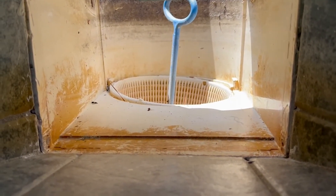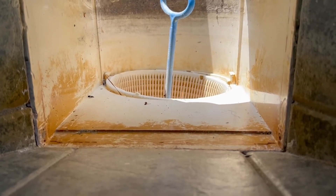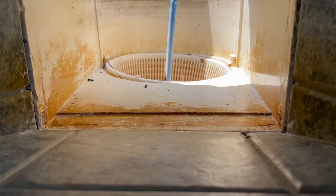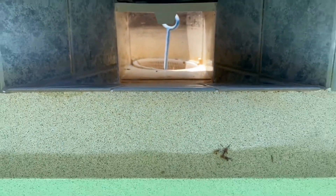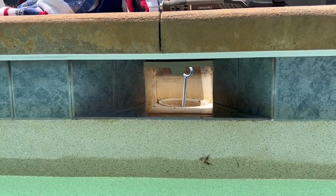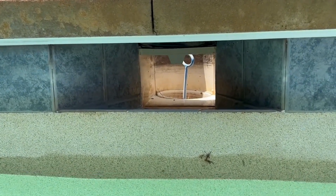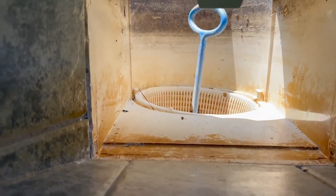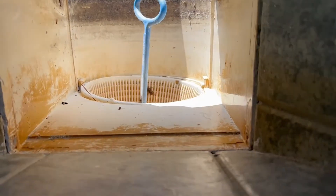This is all done. We took our shop vac and shop vacced it out. Notice how dry it is. You notice that the water has been drained about four inches below the skimmer throat, and you want to do that for at least 24 hours before you start performing this process.